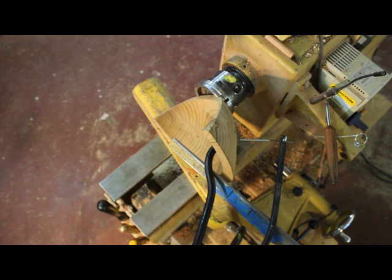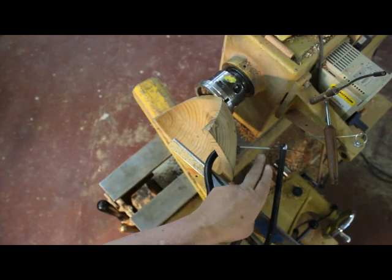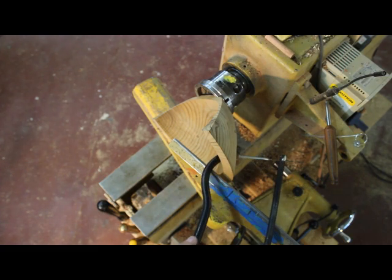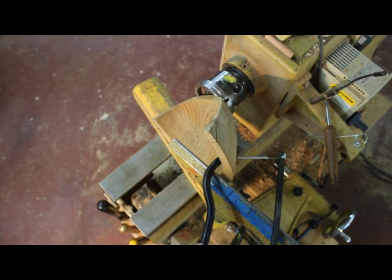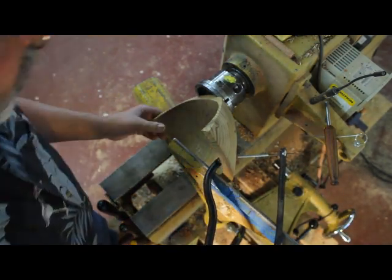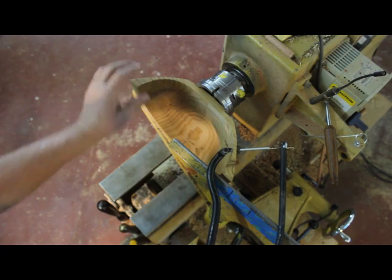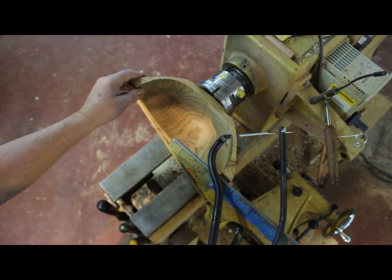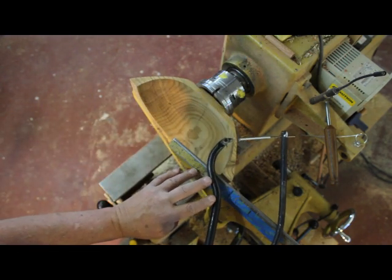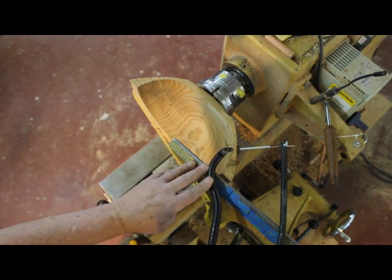With this overhead view, you can see where the tool is riding on the tool rest, and here's the depth gauge. If I have set my depth gauge to the correct depth, I can look at that gap and estimate my depth. Up here towards the rim, I'm too thick — this bowl simply didn't make it through quality control, so I use it for demonstrations. I can unlock my spindle and show you the profile of the bowl. You can very quickly hollow something out because if you get too thin, you're going to have too big of a gap in there. You can also turn this cutter to make more of a scraping cut along the edge for a finishing cut.